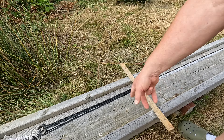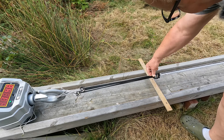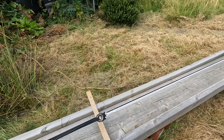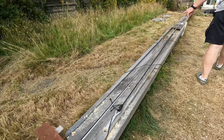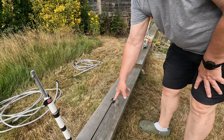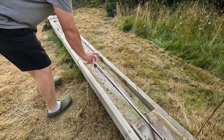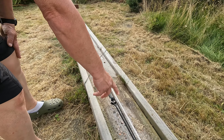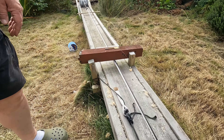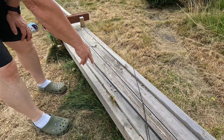We took it up to about 1200 and have left it for about half an hour. To try to tension it, we've used multiple low friction rings to keep friction down - three rings in there, so that should be six parts. It comes up through that low friction ring, doubling the load, and comes back to a strong point anchored to another low friction ring on our latest design. That means we can just take up slack whenever we re-tension to adjust for different length shrouds.